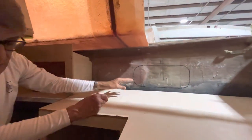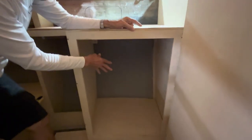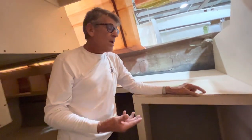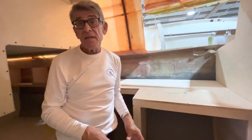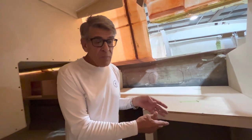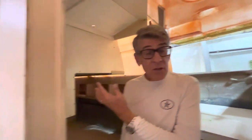We have a hanging locker outboard. We're going to do a book rail across here for book storage and a bunk rail around here for storage on top. This large hanging locker was actually built large enough for the washer-combo dryer. All the washer/dryer units we put in are vented units so they do operate like a normal house unit would — obviously smaller capacity, but they actually work well. We've installed 30 or more units and everybody's enjoying them. There will be a hatch here and a couple deck ports for decent ventilation. The guest cabin will also have an option for air conditioning and heating.